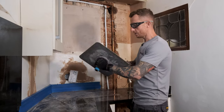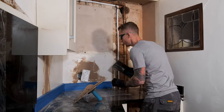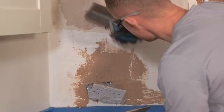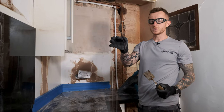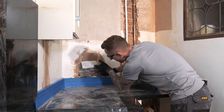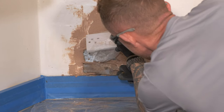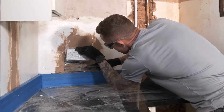When you're applying the bonding don't just whack a load in. It may be necessary to put in small amounts at a time and work it into the areas that you need it to go into. You can see where it's curled up here — squeeze it in and then just run your trowel up. You can't always get your trowel underneath so things like a margin trowel or a small tool work well to get into little areas like that. Also make sure that you fill in the hole completely with the product — you don't just want a little layer on top. Squeeze it right in and go over it again to push it right in. Any excess that goes into the socket you can just scrape that off afterwards.